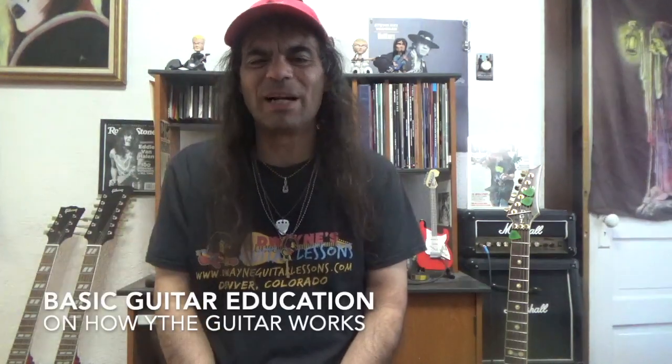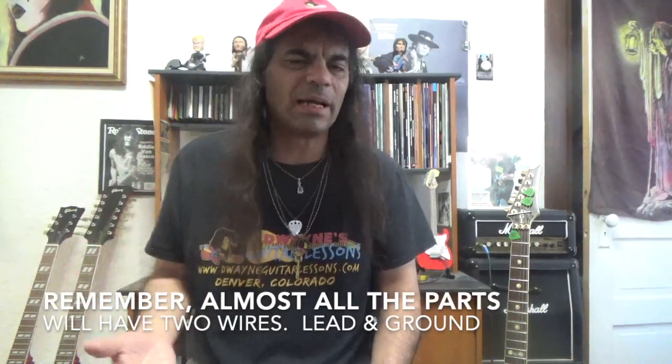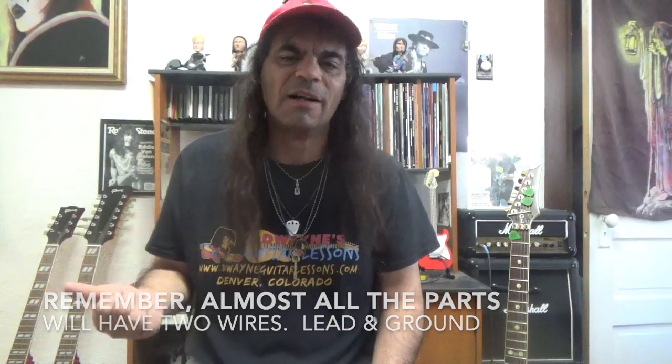Okay, so there's a few things about your guitar, a little bit of guitar education on how your guitar works. There's much more where that came from, but I just wanted to show you a few basic things. That output jack has just got the two wires, so if you ever have any problem with that, check that. If you have any grounding issues, check that. Any buzzing or anything, sometimes that's a problem, as you can see in that guitar. Just that wire came off, and you just strip it down, resolder it, boom, it's good to go.